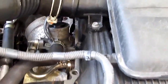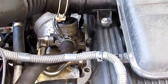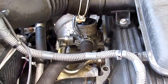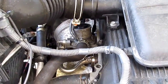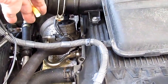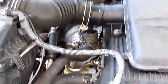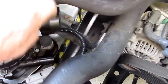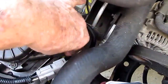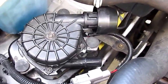Back here at the diverter valve: when you take off that hose, look inside and you can see the valve actuating. You can run that same 12-volt jumper over to the solenoid valve and check it - you can probably hear it actuate. Also, look inside the exhaust tube that goes into the diverter; you can see the impeller blades in there and check if it's all gummed up.